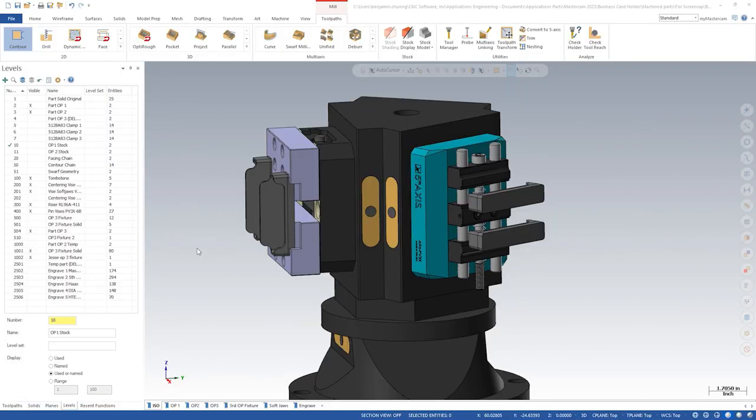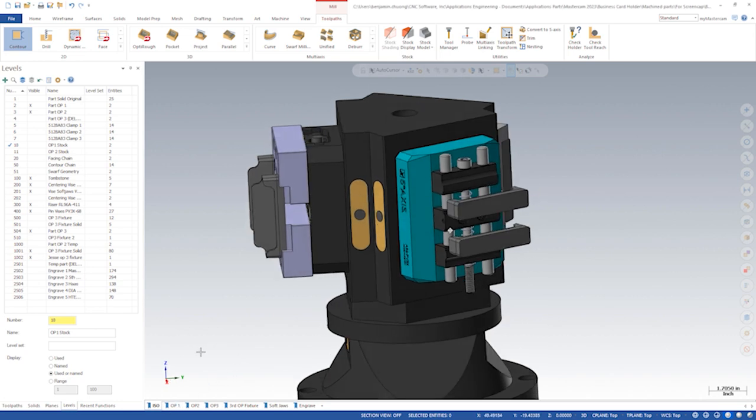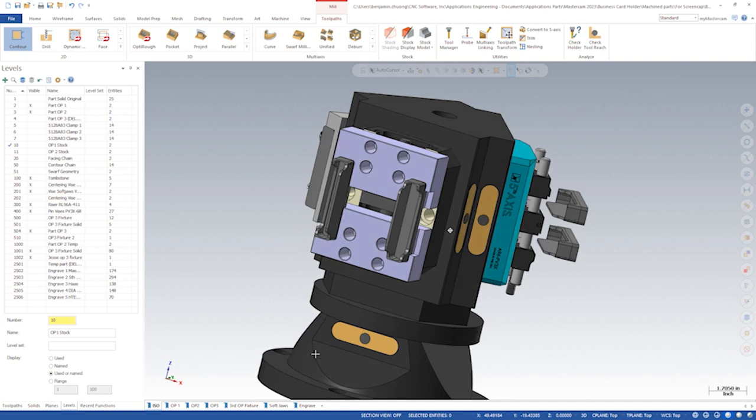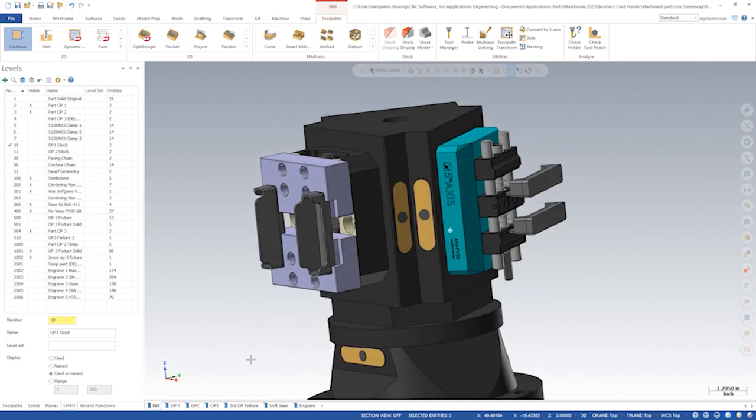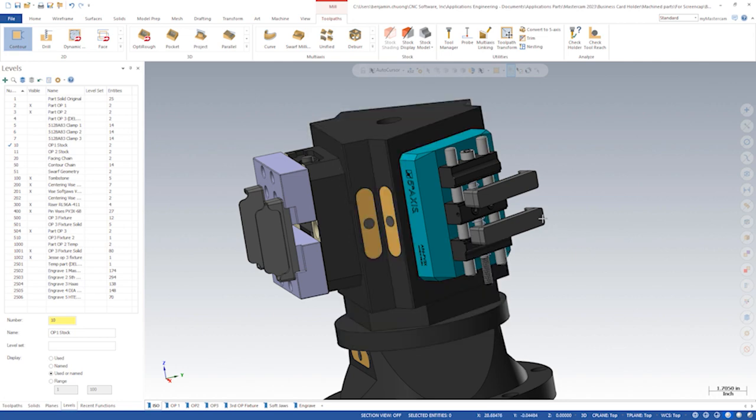The first thing I want to do is copy my parts to each fixture in the orientation they'll be on the machine. At first, to prove out the program, I will work on completely machining each setup at a time. These toolpaths will be the same toolpaths used on a single setup 5-axis video. Additionally, we'll have to program the first setup and the 3rd engraving setup.